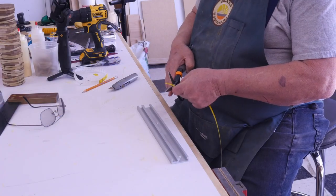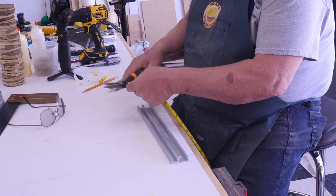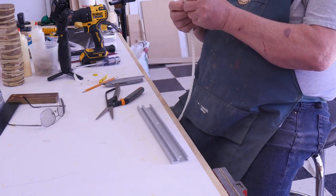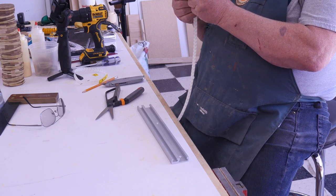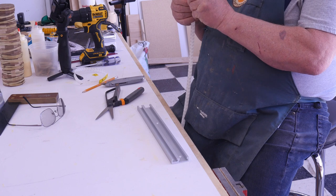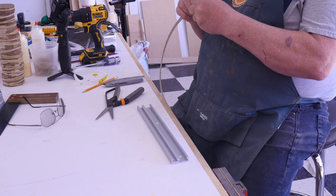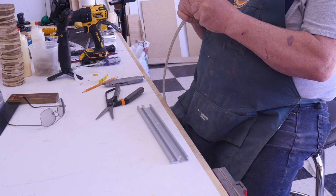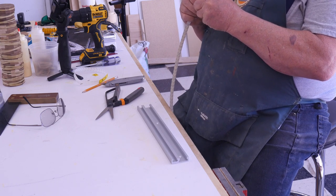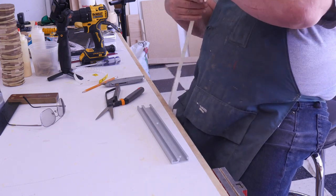So after cutting our miter bar to the correct length, we wanted to put a tape measure in there to make it easy to make adjustments on the size circle that we want. Because the slot doesn't go all the way up against the blade, we do have to trim off the tape measure a little bit. Now this has a sticky side on it, so we made that trim first, and now we're fiddling to try and get that protective film off the back of that sticky side.